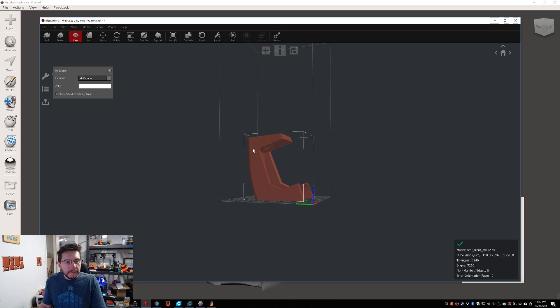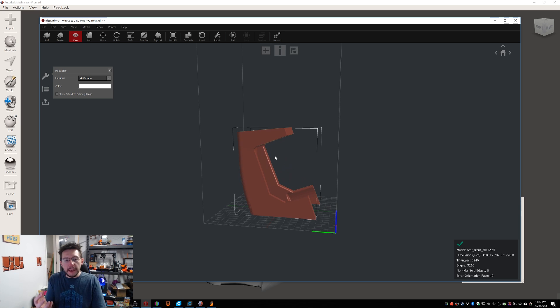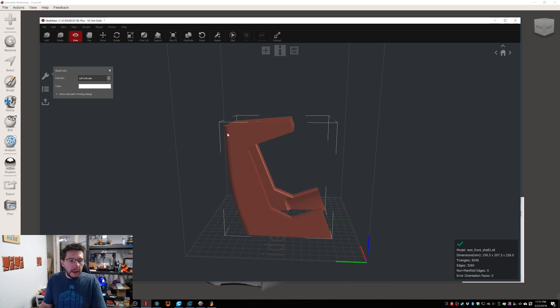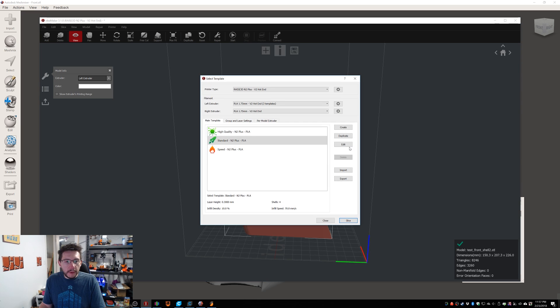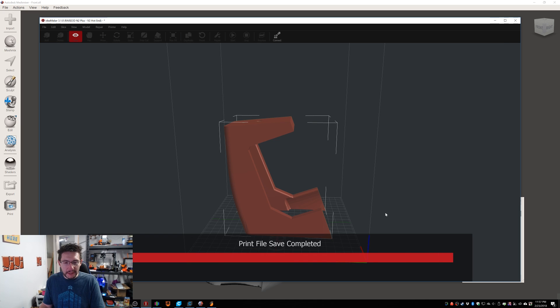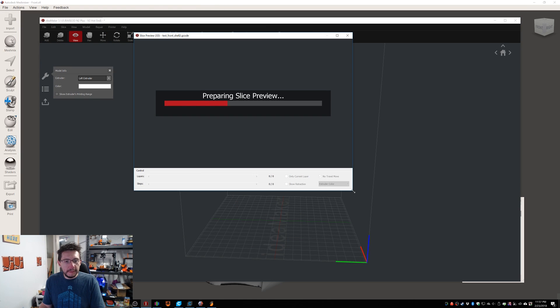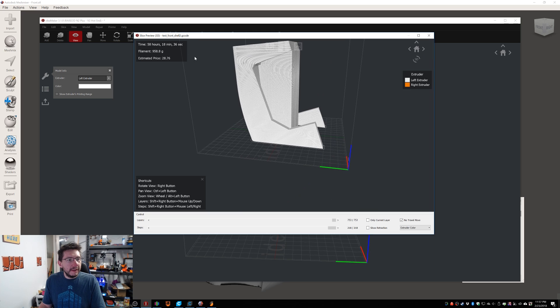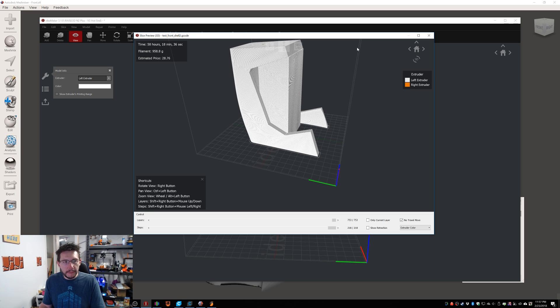The issue, though, is we now have this piece right here — this overhang. When it's smaller it's actually easy to print without supports, but now that it's sized up, we're talking a large amount of overhang. The chances of it messing up are there, and whether or not your printer can handle it I don't know. So if we go in here and slice it — giving it a second because it's got a lot of computational math to do — and preview it: this is a giant block of support. 60 hours to print. Nearly a kilogram of filament. I have a better idea.